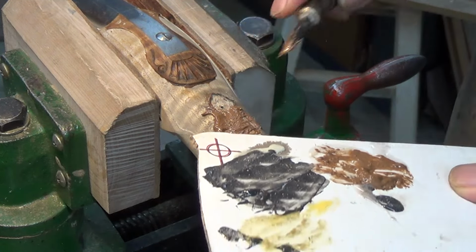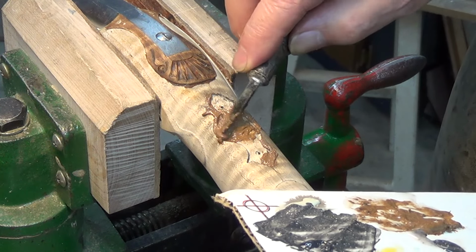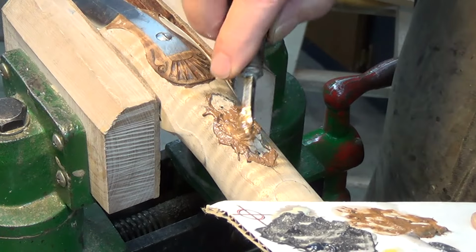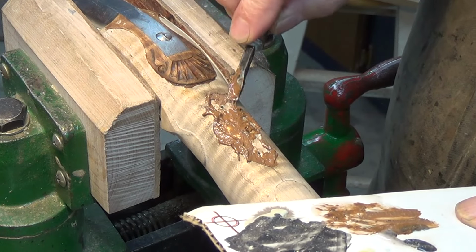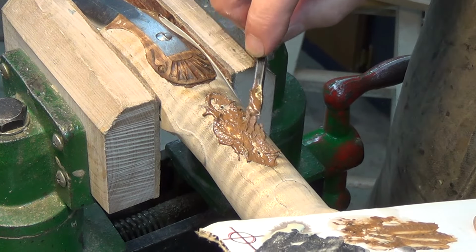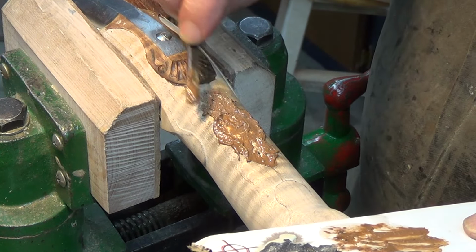Now I know it's a pretty tight fit on this, so I'm really putting it more around the edges to fill any gaps I might have, which I didn't see many, but just to be on the safe side. If you put too much in the center, you have a hard time getting the inlay flat again, especially with the wood fibers in the glue, because they don't compress.